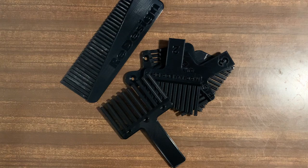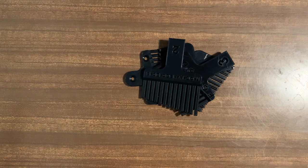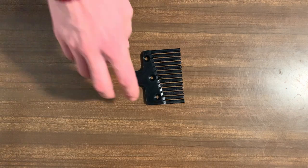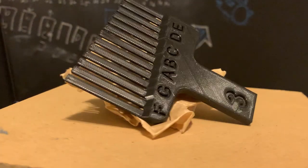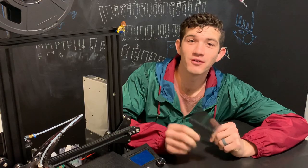Starting with lots of prototyping. I had to figure out the right size for each tooth to make the best noise. In the end, I found that about 5mm wide, 1.5mm thick, and anywhere from 50 to 30mm long made the best noise. So now that we've got the perfect pick, I need to jump on Fusion and CAD up the rest of the music box body.